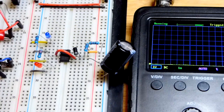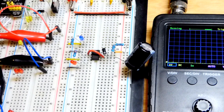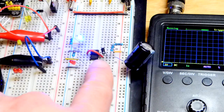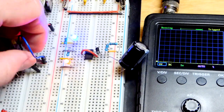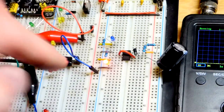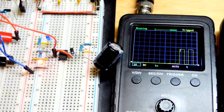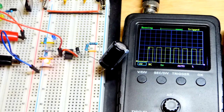We have our circuit. Power supply set to 5 volts — hitting the power button. We got power. There was a brief flash of the blue LED, which I think was just the 555 timer kicking into action. Once the timing got started, the red LED lit up — the output was high. Looking at this with the oscilloscope, I clip into the jumpers. You can see the output moves up when the red LED is lit and down when the blue LED is lit.